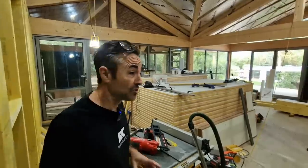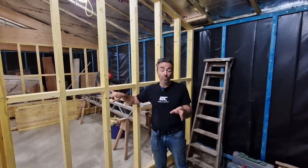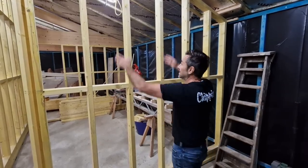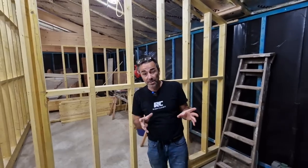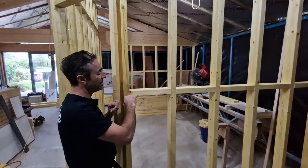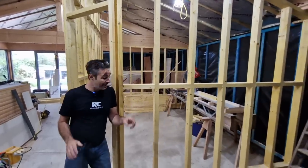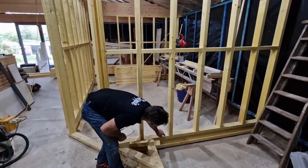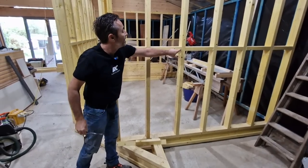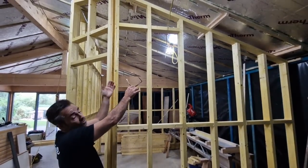We use a noggin or solid bridging in partitioning and it does two things: it keeps everything nice and rigid and also provides a potential board joint. In some countries they always railroad their drywall, and in the UK we often just go straight up the studs. What I like to do when I put my noggin through is always have the centre line one board width high off the finished floor level plus 10mm — so I keep my boards up off the screed level by 10mm. So the plasterboard is caught at the bottom and then comes up, and if we're going sideways across the studs that's exactly where we'd be, and then we'd go on again — you can see another one at the 1200 mark.